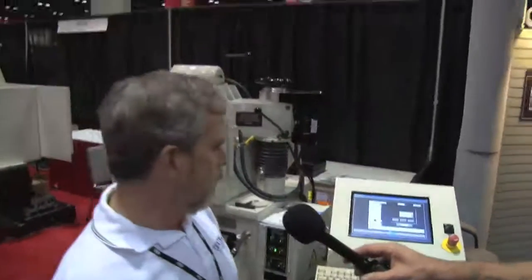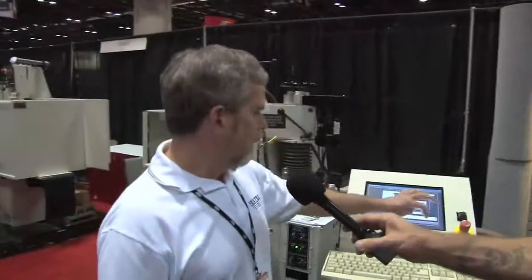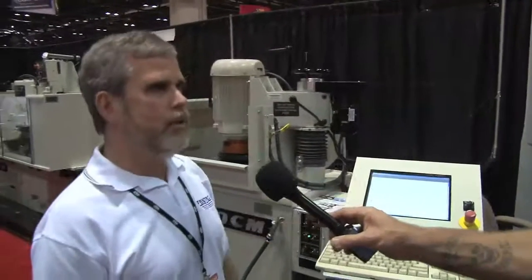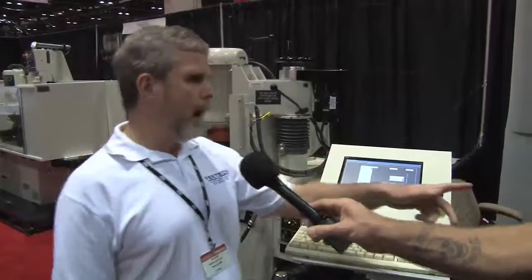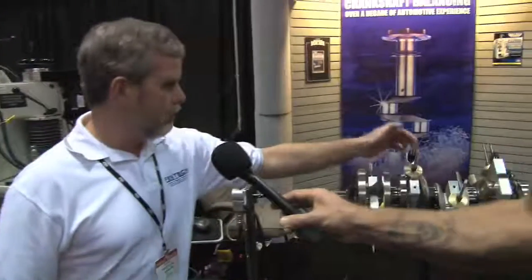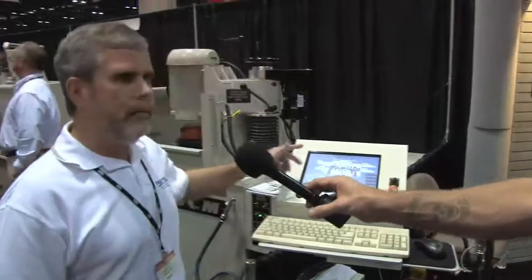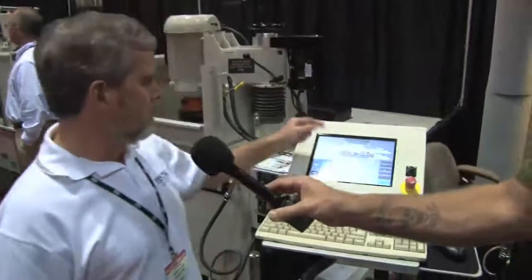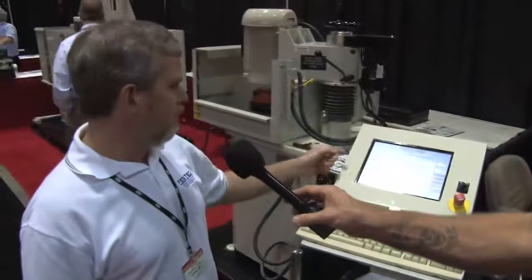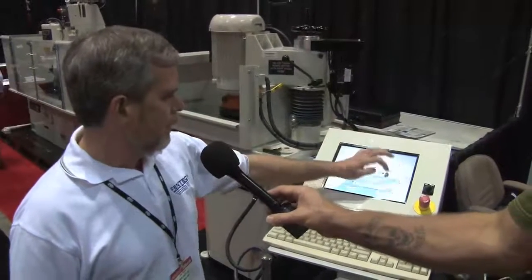It can also do the drill calculation and the heavy metal calculation. The first thing when you set up a balance job is to calculate and figure the bob weights that are used. We've got our external percentages and internal percentages all listed right here at the machine. Once we have our bob weight made up and get our bob weight total, we make up our bob weights and install those onto the crankshaft. Then we go back into our software and hit setup, where we enter all the setup information. This machine has all pre-programmed setups, so if I want to balance a Chevy 350, all I have to do is select Chevrolet, pick 350, and we're set to go.